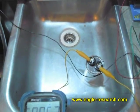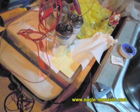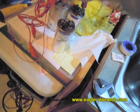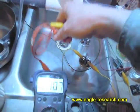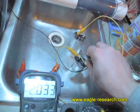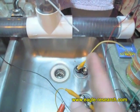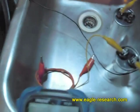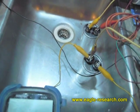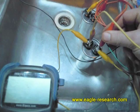We'll proceed to the next experiment, which is to add another capacitor. So we bring the capacitor down, shut off the power, get a couple of test leads, and we've put the extra capacitor in parallel with the capacitor that's already there. So that means you have capacitance coming to this side, and then capacitance going to that side. The meter shut itself off — it gave me a warning and now it's shut off. I'll have to turn it back on when I want to take the next reading. Here's the capacitor on the other side — we've doubled the capacitance.